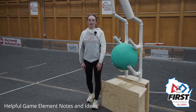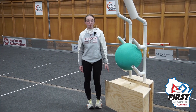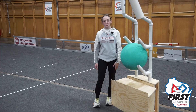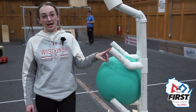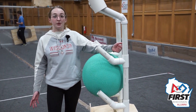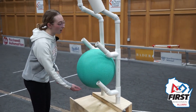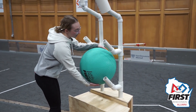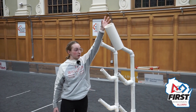I'm Megan with First Alumni of UW-Madison, showing off our field elements here at the Milwaukee Robotics Academy. This is our mock-up of the reef. We used the instructions provided by FIRST to create the plywood and 2x4 wood trough, and then we bought one-and-a-half-inch PVC pipe to build the reef, using 45-degree connectors from the hardware store. We calculated the right pipe lengths to ensure the endpoint is at exactly the same height as on the actual reef. I'd recommend 3D printing connectors at a 35-degree angle, but if you can't, the 45-degree connector is a great option. The algae starts in the reef and is pretty hard to knock off from the top or sides, which is a benefit to our design that scoops and intakes it. The top is right around 6 feet tall, so you can drop coral right onto the reef there.